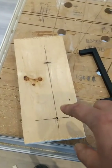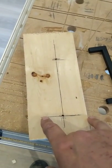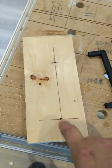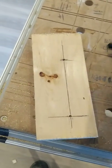You're going to mark the offset of where you want them on the door. Typically we have a three-inch rail, so an inch and a half in and an inch and a half up gives you your first hole. Then you're going to go a five-inch offset from that — so six and a half inches and an inch and a half in.